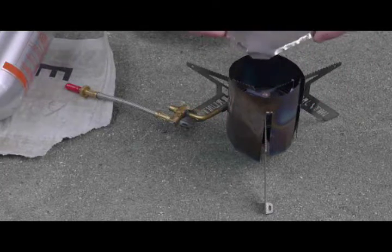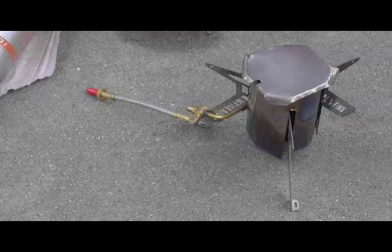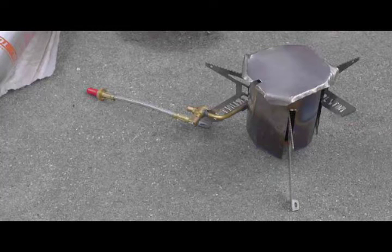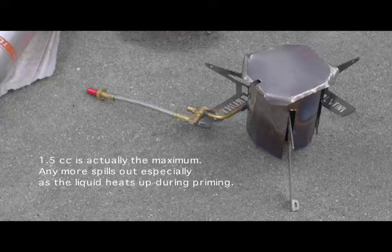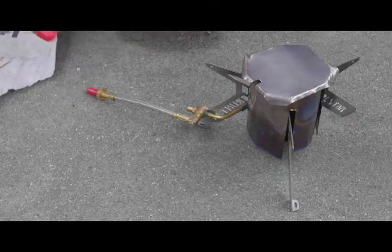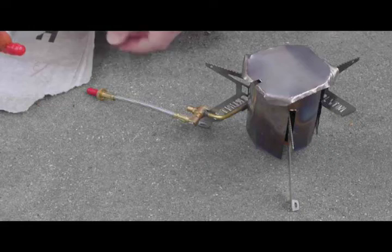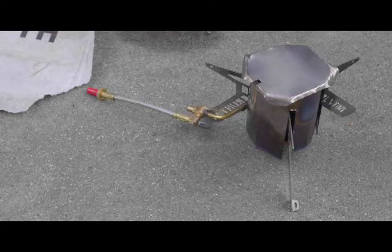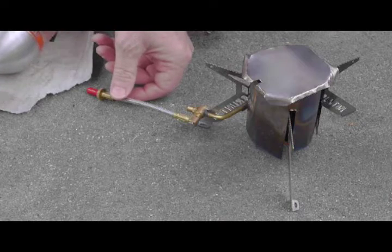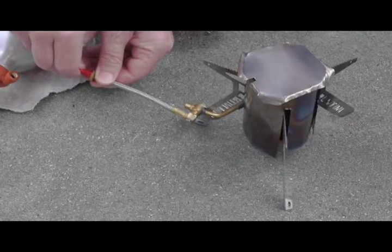I typically have the small notch here for the exhaust gases to come up over the area of the generator. About 1.7 cc is all this Bantam priming pan can hold — I think it will hold up to maybe 2 cc's. The bottle as you can see is not even connected and I haven't pumped anything in it yet. The amount of fluid in this is actually very, very low, so I'm going to only put about a few pumps in. The routine I use for this particular startup is somewhat different from what the manufacturers recommend, which is to have quite a lot of pumps in, but I have found that with the chimney you want really very little initial pressure in the bottle.